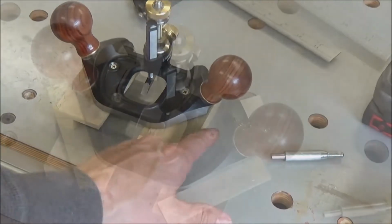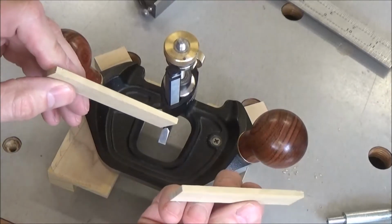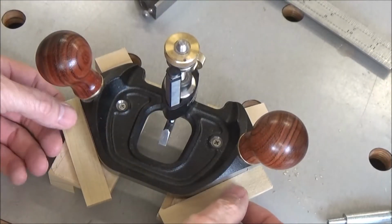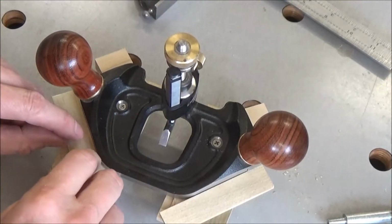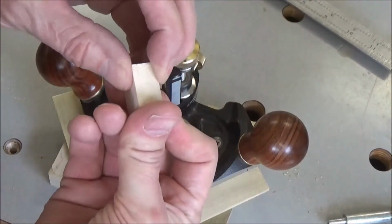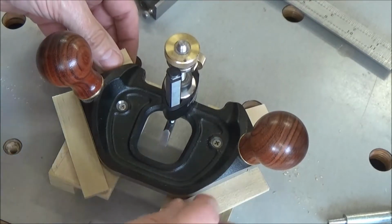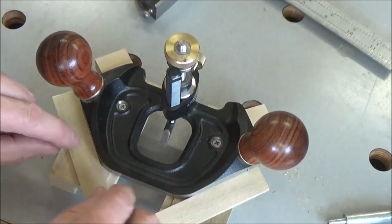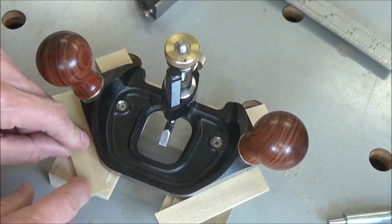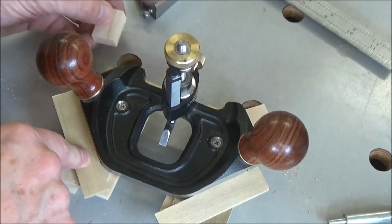Now, in order to keep this located where it is, I'm just going to glue these strips on there, probably 3/16 of an inch, right along here on the edges, and then these blocks are probably a 1/2 inch back here in the corners. Then once the glue dries, I'll trim everything flush and make it look decent, I guess. We'll put it that way.